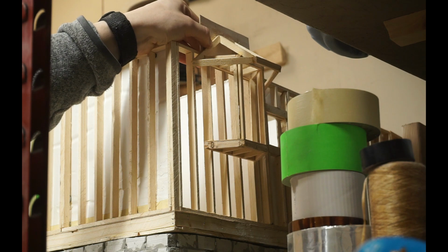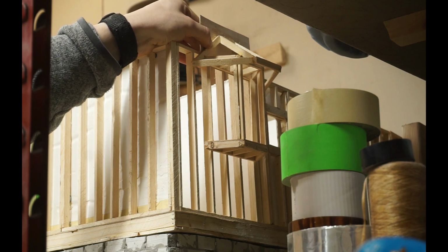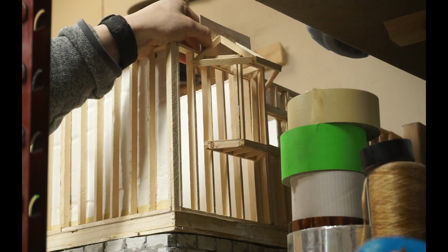I also think that when I put the sheathing on the roof, I might take the opportunity to add some smaller rafters between the hip rafters. I was unsure at the time due to this roof's small size whether they'd be needed, but after seeing it put together, I think I probably need them. Next up, I need to install the bay window to the house itself.